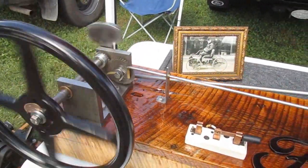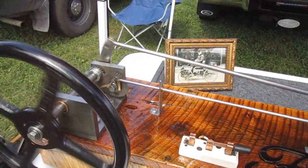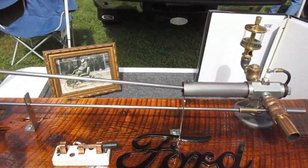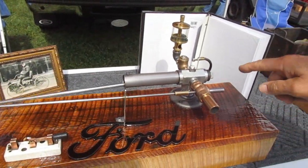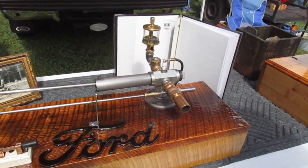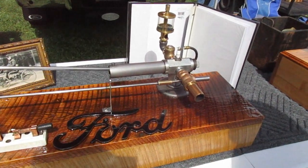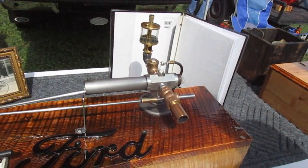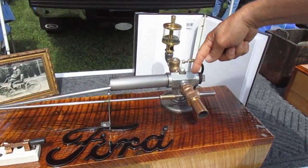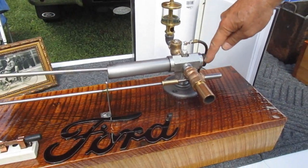The end of it is doubled for double thickness, and then a brass sleeve pressed over the roll pin so it's brass-to-brass contact. I made the brass pieces myself; the parts that had to be machined I had a machinist do. I don't have a machine shop, so everything I could do without one I did. It's basically a T and an elbow plumbing, and the exhaust valve is constructed out of plumbing parts.